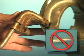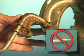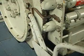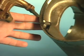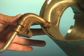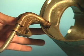This is because the oil tube itself extends into the carrier when the cylinder being checked is at bottom dead center. To check the proper alignment of the piston cooling oil pipe, bar the engine over to bottom dead center of the cylinder being checked. At this point, there should be no binding of the nozzle of the cooling tube and the inlet hole of the piston carrier. If any interference exists, which indicates misalignment, the tube must be replaced.